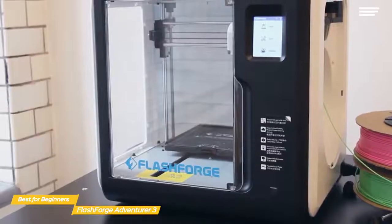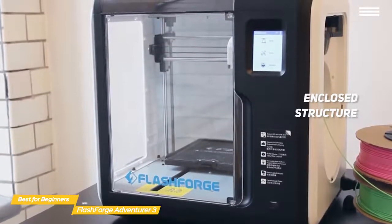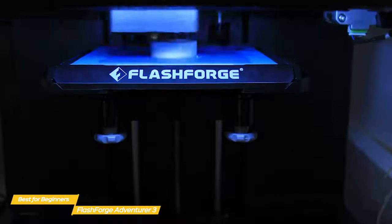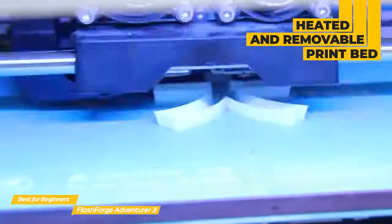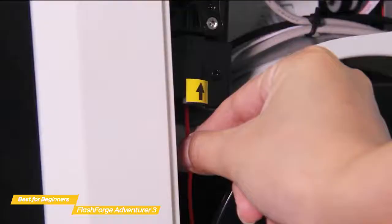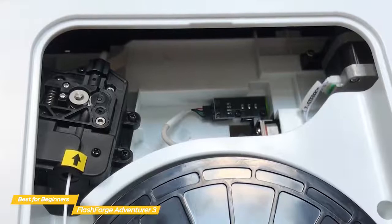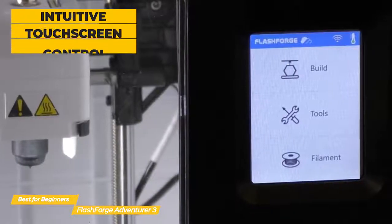The enclosed structure resembles the Dremel 3D45 3D printer, and has a transparent front door, left side, and top, making it easy to monitor prints. An integrated 2-megapixel camera can be used for remote monitoring. The singular print head moves on the X and Z axis while the print bed, which is both heated and removable, moves on the Y axis. A Bowden extrusion system is used as the filament feeding mechanism, meaning the integrated motor is mounted away from the print head and the material is driven through a PTFE tube to the nozzle.